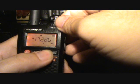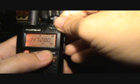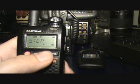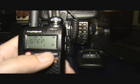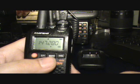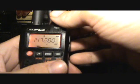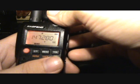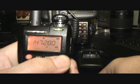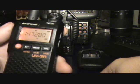Going back into the menu: obviously repeater shift, what the offset is going to be, frequency step with options from 5 all the way up to 25 — those are 5, 6.25, 10, 12.5, 20, and 25 kHz. Then there's volume: push the volume button, rotate the dial to adjust. Push that again to turn it off. Holding the volume button in opens the squelch; taking the finger off shuts it again.